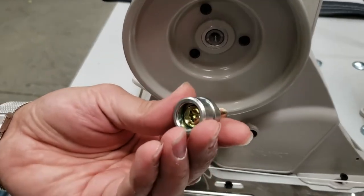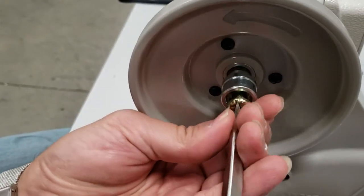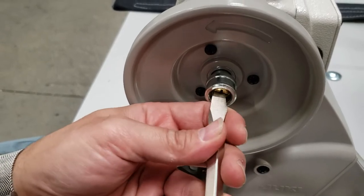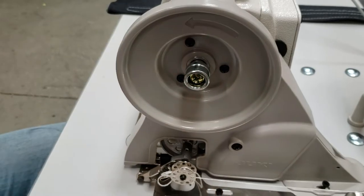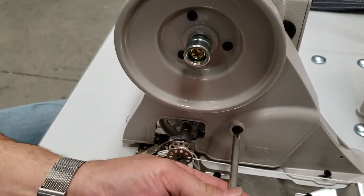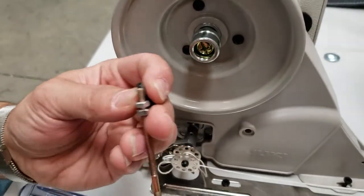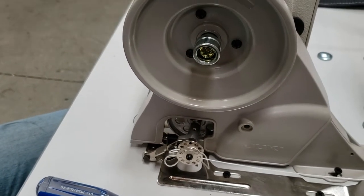Go ahead and take the screw — there are two pieces. Take the biggest screw and put the adapter on. This is on a Juki 1181 — make it tight, very tight. You can hold the wheel and tie the screw. Then open the bottom right side screw — the original that came with the machine — and put in the smaller one from the needle positioning system kit.